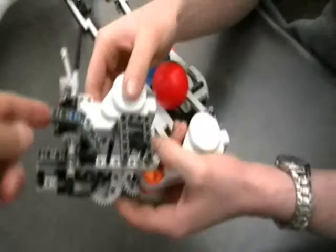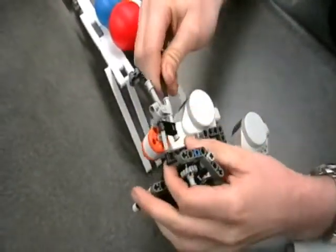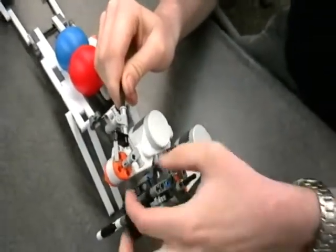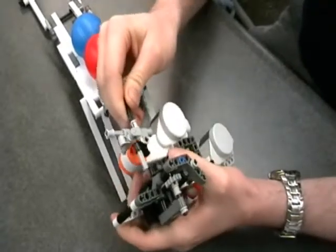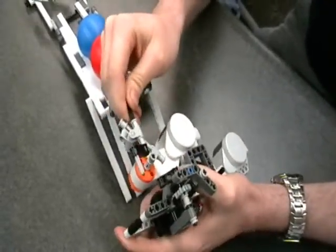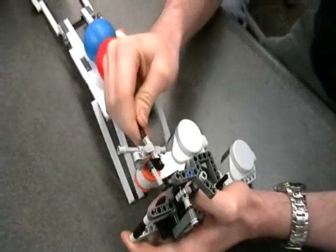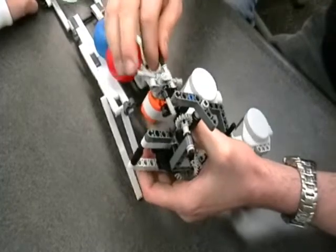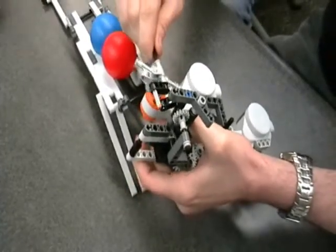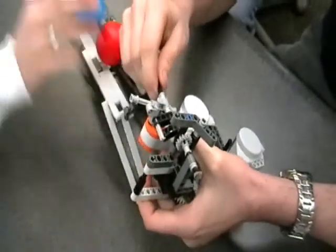So how can you make that? Basically, this is like the output of the transmission — it rotates here, very, very slow. And this motor can pull away or engage the clutch. So when it's hooked up to here, the axles stay in line, but the rotation of this motor can engage or disengage. So you make the clutch.